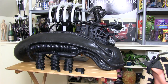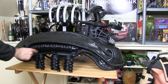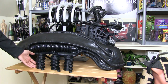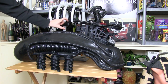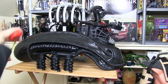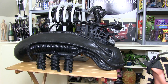From last time I had several parts printed out which I haven't attached to the head yet — these parts which are basically sections with a conduit holder in the bottom. These will stack up in one long line to make the sort of dual-sized hosing which will stick along the side of the head. This is my clay sculpted version I did a while ago which I stuck curtain rings in the clay. I need to mount all of these end to end in a giant stack along the end of the head, so I need to make a mounting piece that keeps them at an angle — they should stick out slightly more than I've got there and be slightly curved. Each stack is about 120mm which means in total we've got 360mm, roughly the size of the clay version.